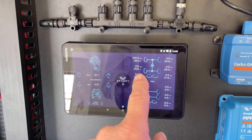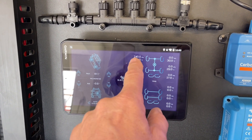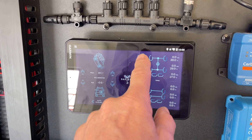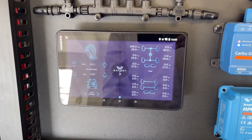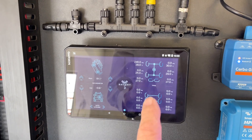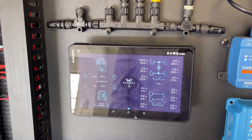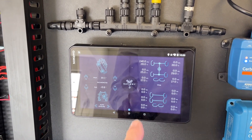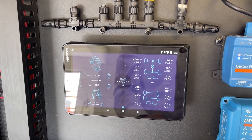What we have in here then is the alarm functionality that the user can set, and it can also detect rate of pressure change. So what you've got to watch for is: is it a slow leak or a fast leak? We're able to detect that and have two entirely different alarms that flash up on the screen - that's invaluable.